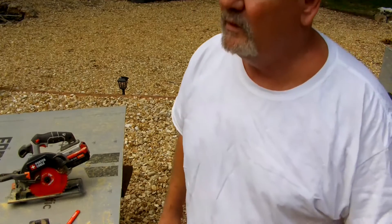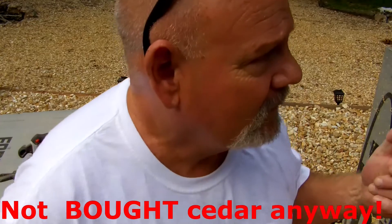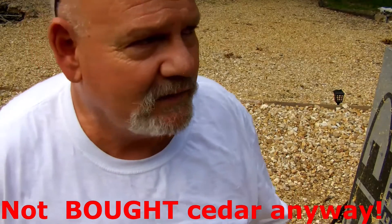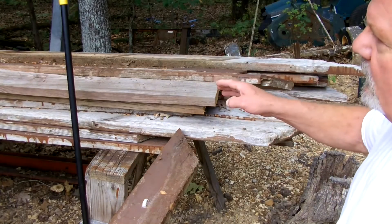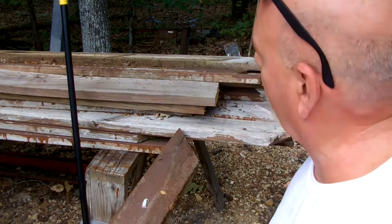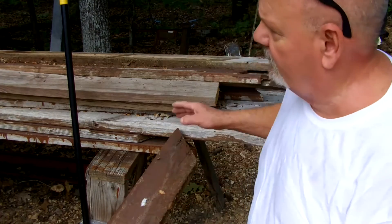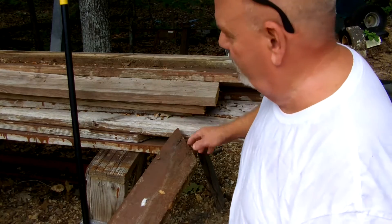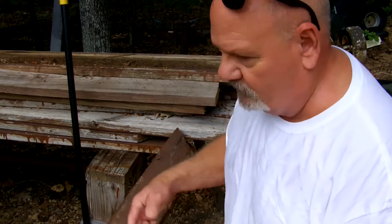I didn't even think about the two-by-fours. The ones I got in the shed here are cedar, and I'm not using cedar on this. I might have a couple eights back there I can rip down. That's why you never throw anything away — this is what's left of the old deck. I saved everything six foot, four foot, and bigger. It was cedar, built about 30 years ago. I think I'll find a couple eight-footers and rip a three-and-a-half-inch, two-by-four size out of them. Use the rest for firewood.